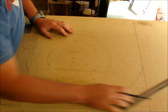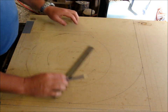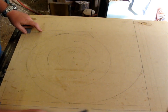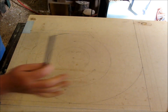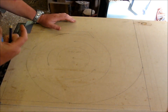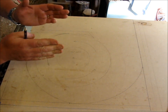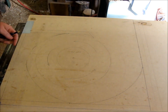Also, I went about a 1/4 inch here, or 3/8, on my stripping edge, because the way this is going to be built is here, here, here, and then right down through here is just going to be the case. Alright, and it's going to be the width of my impeller plus a 1/2 inch. That'll give me a 1/4 inch on each side of the impeller for clearance, because it did have a little bit of wobble in it.